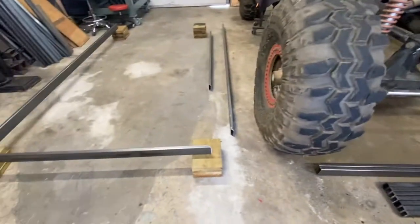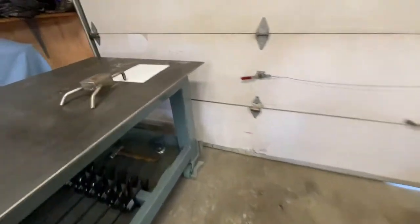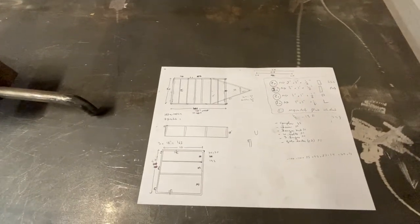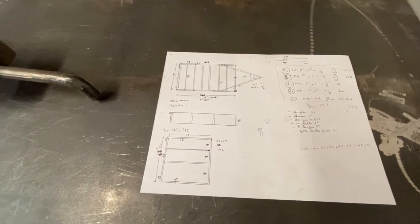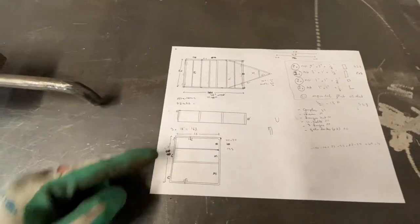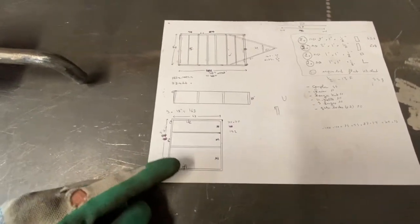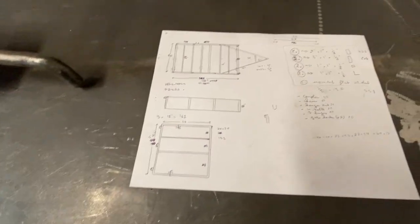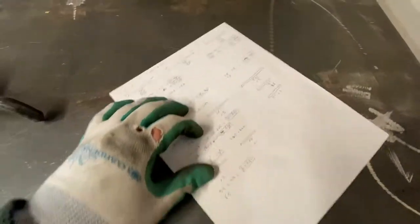When I got the steel this morning I basically already had the plan done for the trailer, so the majority of the work is basically just designing the trailer. I've spent some time in the past week going through all the dimensions and designing the frame. This is the frame, these are the sides, this is the door - it's going to have a tailgate that drops down. I did change the dimensions just a little bit, I increased the height of the door from 48 to 54 inches, then calculated all the materials that I needed to buy.